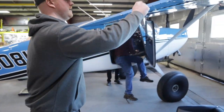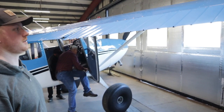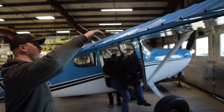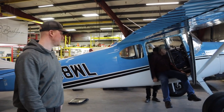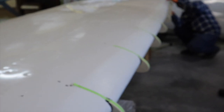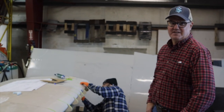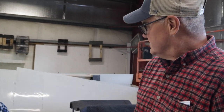I do have a big one actually. These are non-structural fasteners — these have to be structural. They're stainless little beautiful fasteners. These are on the aileron screws; they've got to be structural. AN525-10R, probably size 8. Sportsman STOL — the only way to go on a Cessna wing. Steam Aviation — give Will a call up in Montana, he'll set you up. I think these guys install more of these STOL kits than anybody.